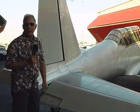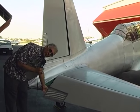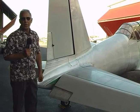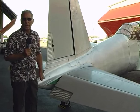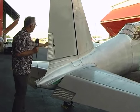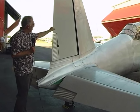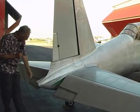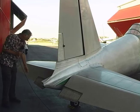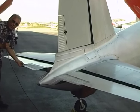That was because they had a shortage of metal during the war. And actually some of the trim tabs would be wood too instead of metal. There really aren't any of those flying around because the parts are impossible to find, and if you did find them the wood wouldn't be any good. Here's your rudder, and this has a metal trim tab on this one. Of course this has fabric on the rudder here. And this is your tail nav light, which is normally white on this airplane. Here's your elevator — this airplane has dual elevator trim tabs, and they work simultaneously up and down together through a lever in the cockpit.